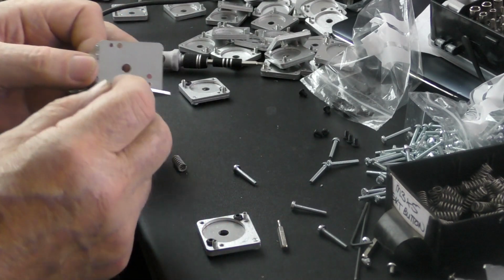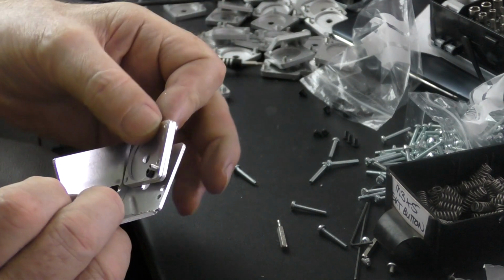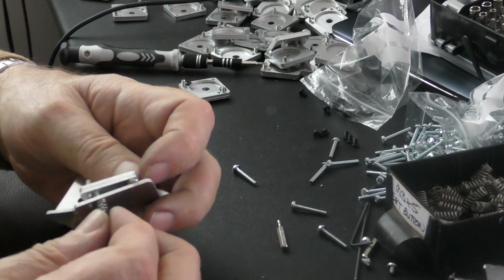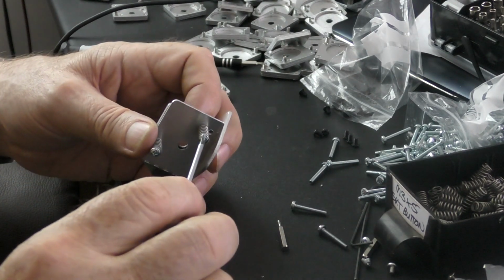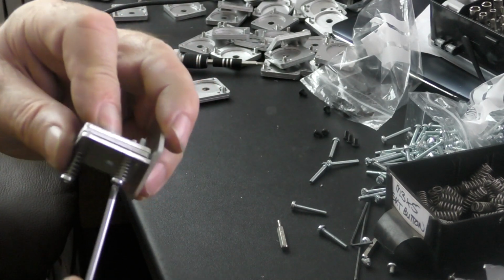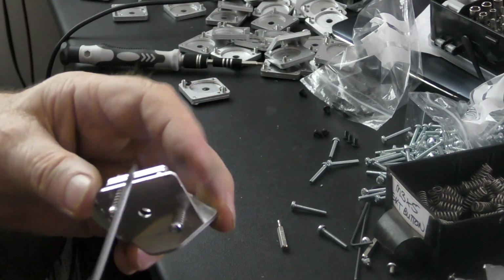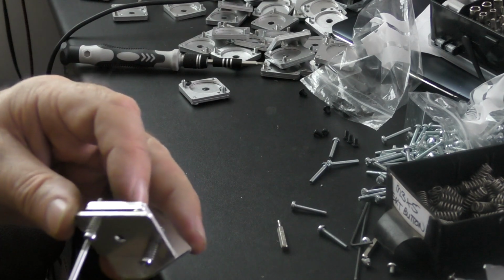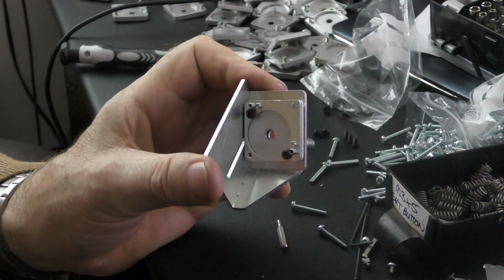These are the same 20 millimeter long pan head screws, M3. Put them down the center of the spring. So the pivot point there goes into that top right hand corner, just there, and it's the only remaining hole there, which allows you to put the screw in with the spring. Okay, then you can wind it through so that there's approximately 3mm of thread sticking through the front of the mirror, and that will give you approximately the right tension on the springs, and it will also provide somewhere to plug a target onto for aligning the mirror.